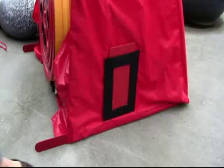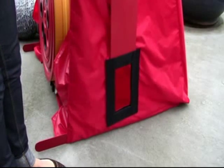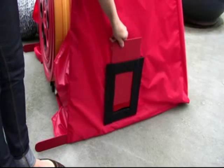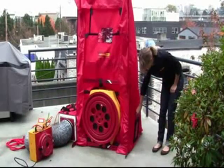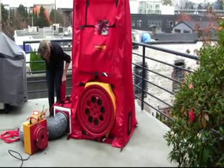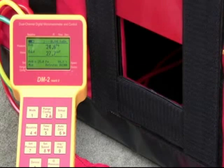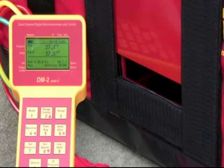You are now ready to create a variety of testing scenarios performing the following tests: total house leakage, total duct leakage, and duct to outdoors. There are three sliders included with the training simulator to simulate leakages throughout the home. Scenarios are created by changing the sliders on each side of the simulator. Here you can see our gauge measuring the duct leakage from the duct simulator. As the leak gets smaller, so does the measurement on our gauge.